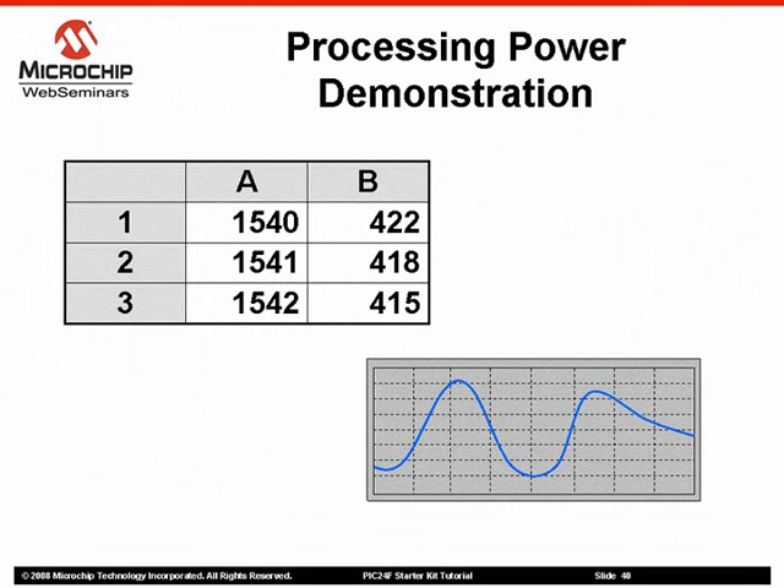After exiting the demo, remove the flash drive and insert it into a PC. Use the spreadsheet program to open Capture.csv. The first column is a timestamp of the data; each number represents one 10 millisecond interval and is the number of intervals since the demo began. The second column is the raw potentiometer reading. Use the spreadsheet program to graph the data column. Note that the data displayed on the starter kit's graph is not guaranteed to be at a fixed time interval, but the data captured to the flash drive is guaranteed to be at a fixed interval and can be used for analysis.